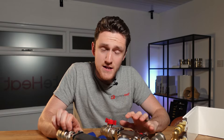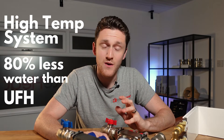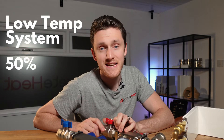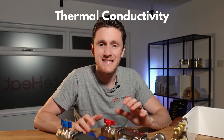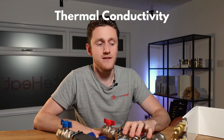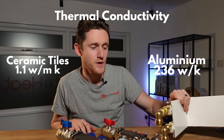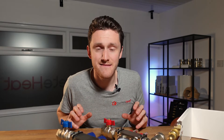If you're on a boiler, thermoskirt's water volume compared to underfloor heating is typically one-fifth. If you're on a heat pump, thermoskirt's water volume compared to underfloor heating is typically one-half. That's because underfloor heating emits its heat off a concrete surface whereas thermoskirt emits its heat off an aluminium surface, which has a significantly higher emissivity of heat per square inch, and therefore you don't need anywhere near as much surface area to emit that heat.